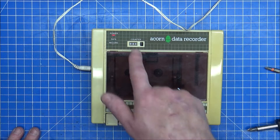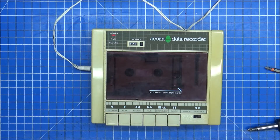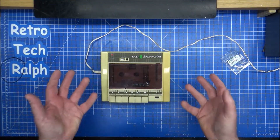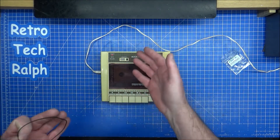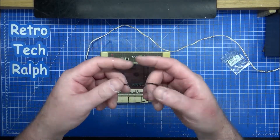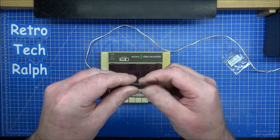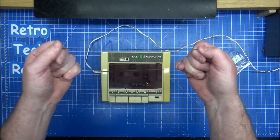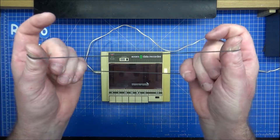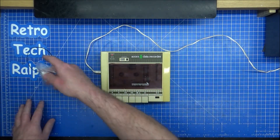Play button — that's going around. The counter does not go around because there's no tape in, although I'll press rewind. I actually couldn't find a tape to hand at the moment, but everything's done. The belt's on and the counter belt is working perfectly fine — done, I'm happy. It is an essential fix done anyway. So this is the original belt. It doesn't feel as rubbery as the replacement. The other one literally just went straight back to oil. That's actually not bad, it hasn't got too much stretch on it — but if it's got too much stretch it won't grip around the cogs. It needed doing.